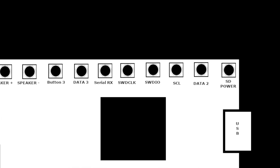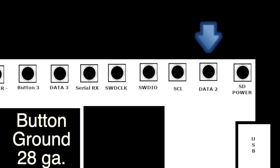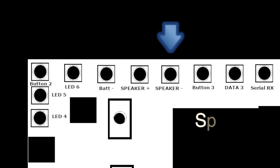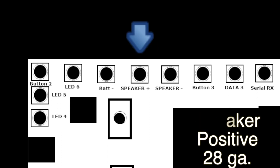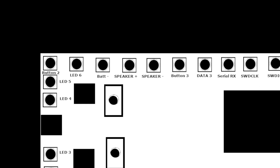Okay, now we're going to have a look at the other side of the Proffie board. We're going to start right off here with data 2. There's not a whole lot to do on this side, so we're just going to skip all the way down and go ahead and solder in the negative speaker wire, which is going to go right here, and then do our positive speaker wire. With a little bit of luck that should be everything that we need to do on the Proffie board itself as far as wiring, so let's go ahead and give this a shot.